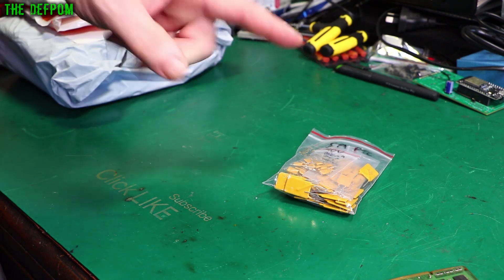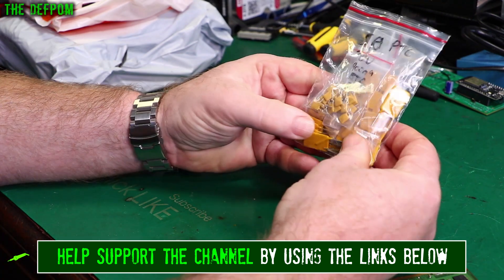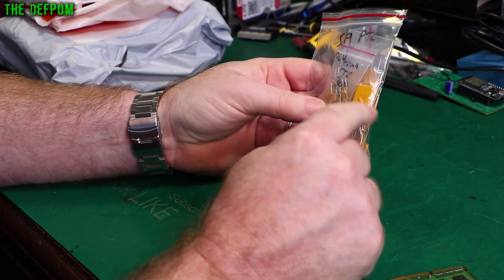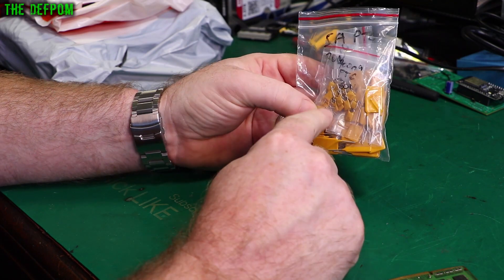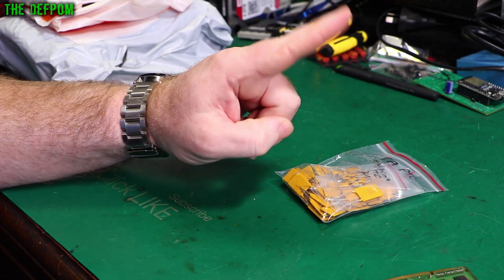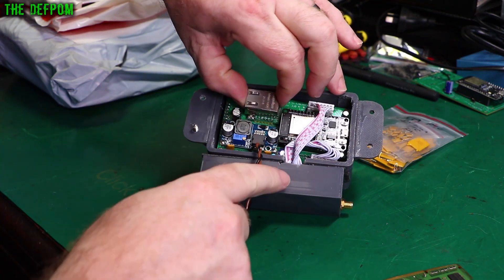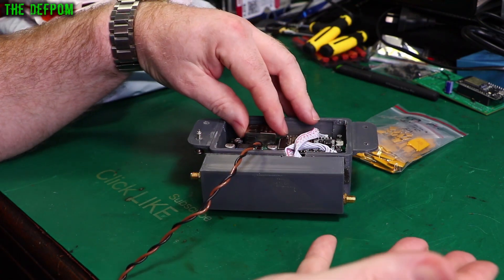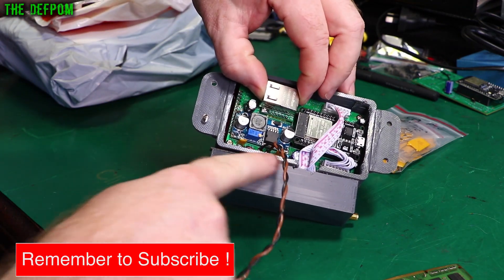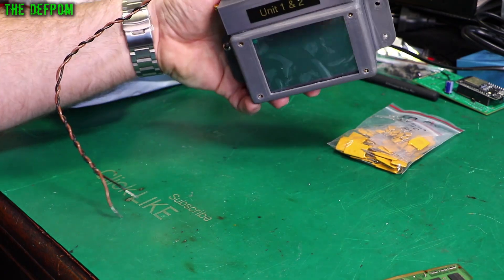I confess I've opened this one up already. Reason being, I needed some of these and I was actually waiting for them. What we've got is a range of different PTCs — some from 900mA up to 5A, which are the big ones over here. I've used these 900mA ones in a project, which I can show you. So this is the project I've been building. I did a sponsorship video with PCBWay for this to get this board made — that's the way I designed the board, they manufactured it, and I populated it. There are the PTC modules sitting there, two of them, on the power supply section.